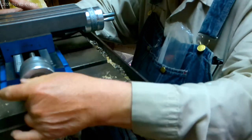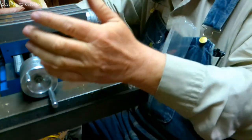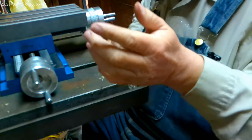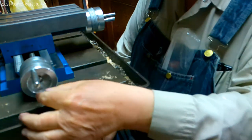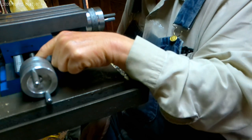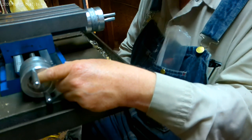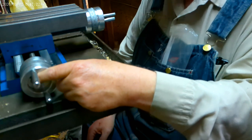One of the things I don't like is that the control is right on the tabletop. I really wish this base was a little deeper because that's going to make it right down there where you can't get to it hardly. I don't like doing anything left-handed. Just like Bridgeports and those machines, the controls are on this side, but most of those high-cost mills have controls on both sides. There is a bolt here and a screw that fastens to the feed screw — I think I could put on a low-speed feed here, but I don't think it's going to be necessary. This is only three inches of milling at a time, so a feed is going to be kind of useless.